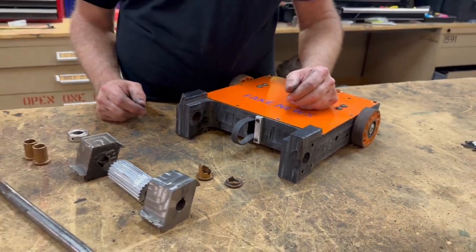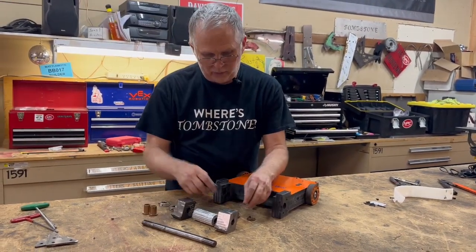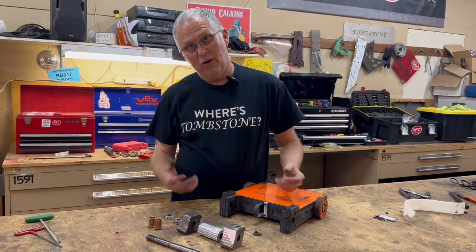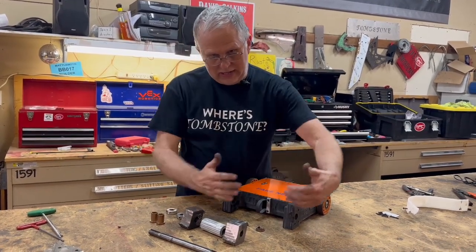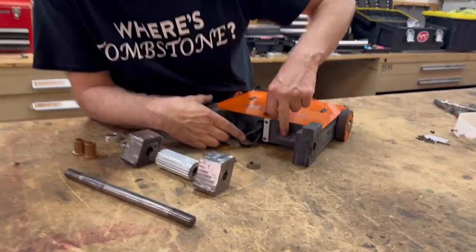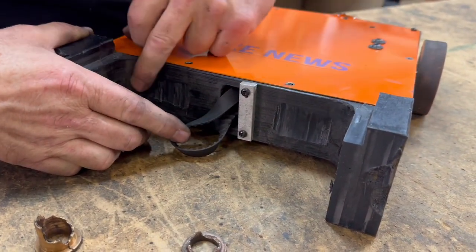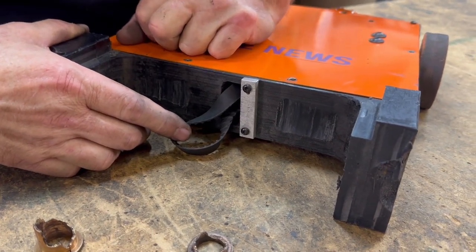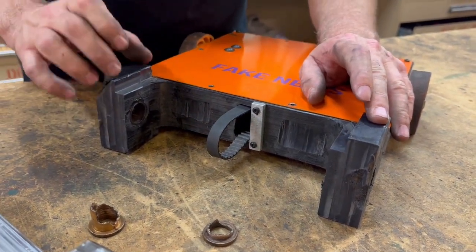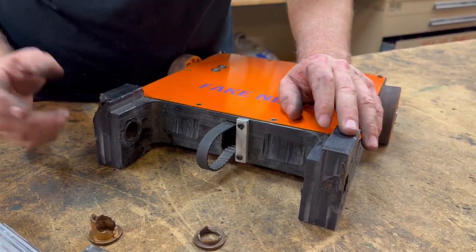And so for the last 2 matches that this robot had, the shaft wasn't spinning on the bushings. The bushings were just spinning inside the plastic. And that's how we were able to keep spinning through all of this. Because it moved around in there and it wasn't tight anymore, the weapon could actually come back in and start chewing into the body. So the weapon was machining away material out of the frame. So I like using the UHMW. This was a really good idea, but the bearing setup for this weapon was poorly thought out, and it came back to bite me.